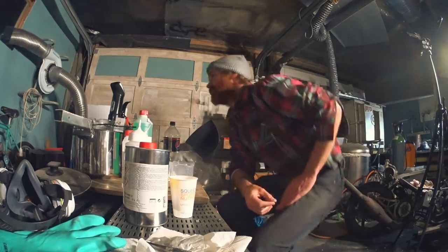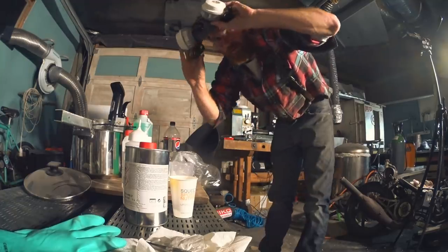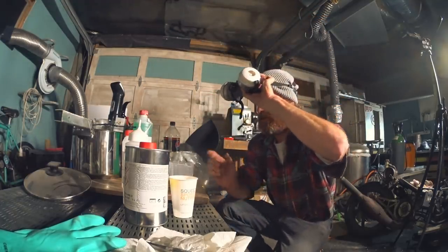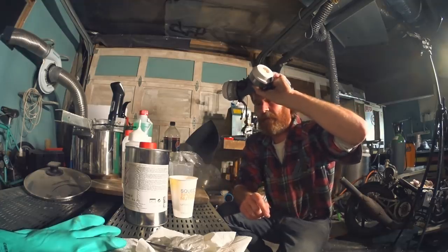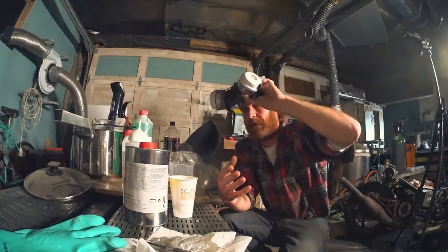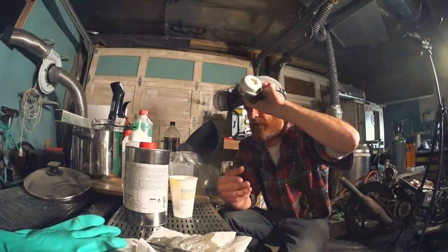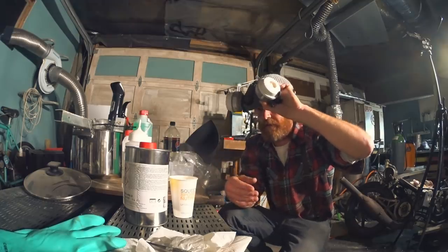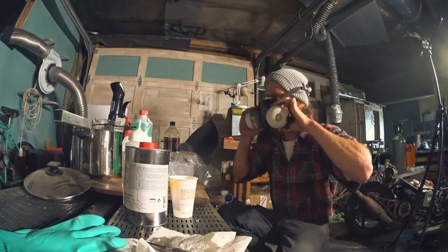Okay, let's get started. We're up to temperature now. I'll do a 30-minute plating this time, just to see how it works. I think it will put on about 10 to 15 microns an hour. That might be enough, but thicker might be better. So half an hour, 5, 7 microns, something like that. Enough to do some testing.